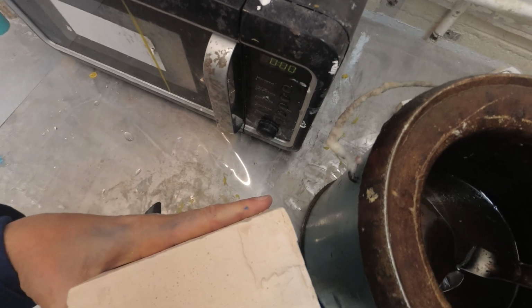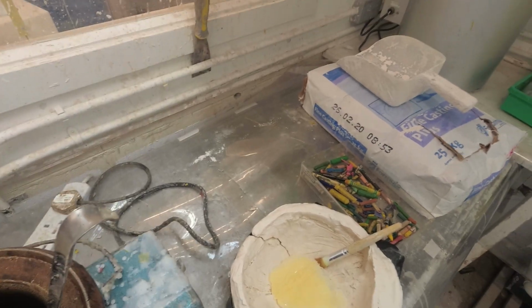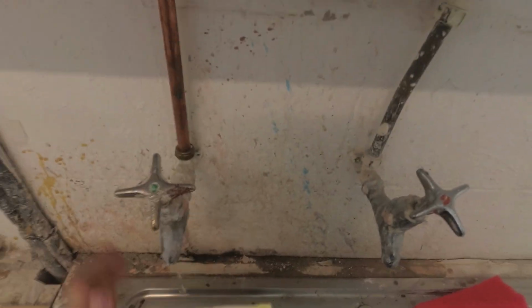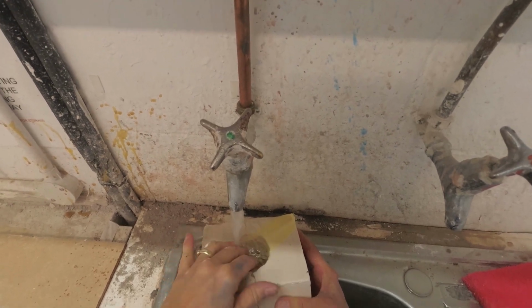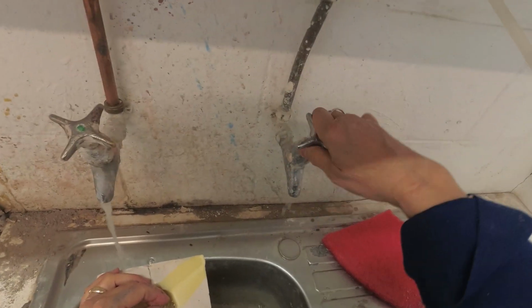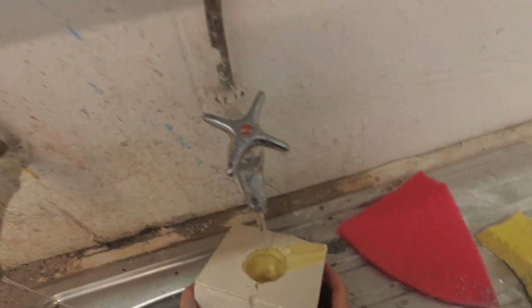Okay. It's actually sealed itself up towards the bottom there. It does get quite narrow. However, we'll see. The thing now is to wait a second or two and then pour water in. And the cold water very quickly sets the wax. This is colder. So just leave that sitting with cold water running into it.